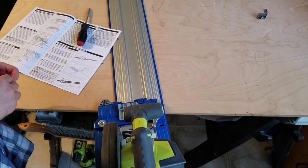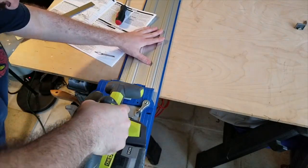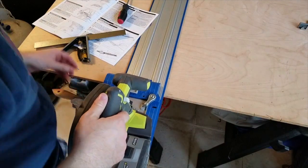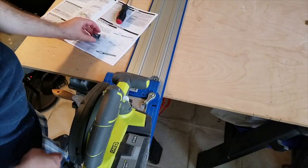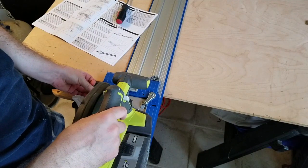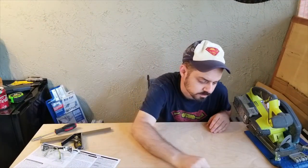I'm going to put in the slide indicator clip and the cursor. I'm going to cut the part of this guide strip, and now adjust the indicator a bit better. Then slide that right on there. Now I need to put in the indexing stop. This indexing stop is for when you want to remove your circular saw but you won't lose your spot of where you had measured it. I'm going to place this one right here, make sure it is square and tight up against your saw. There you go — I have trimmed off the edge guide so it is nice and straight.